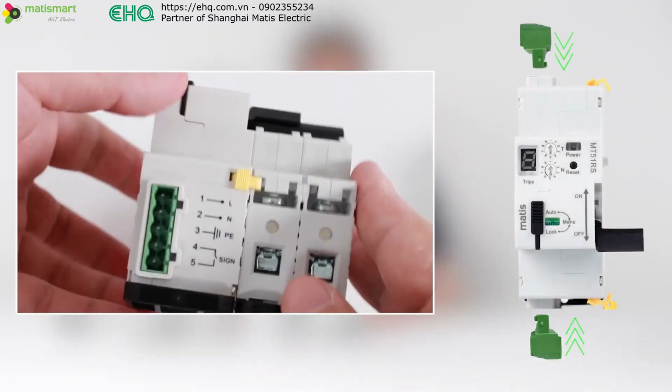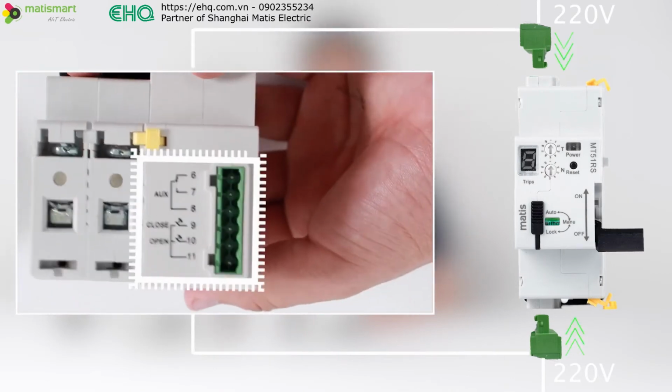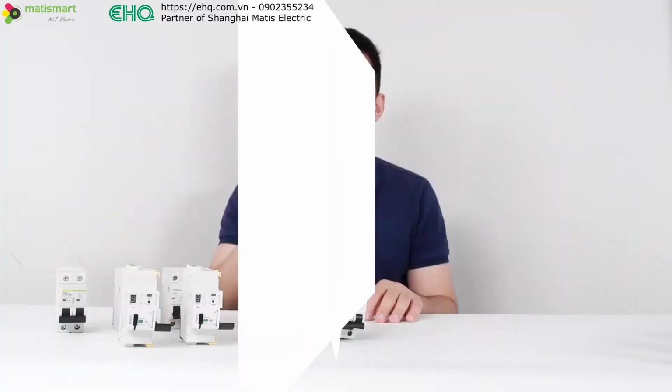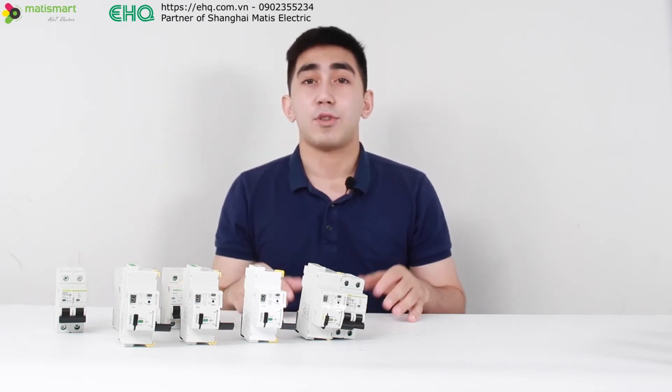We also have terminals. There are terminals at the top and bottom of the device for remote control. There are several options for remote control with this device: dry contact, wet contact, and also RS485. If you are not familiar with these terms, you can pause and read in this window. We will also leave an article on this information at the link in the description.